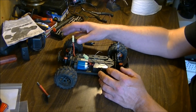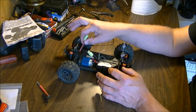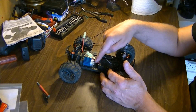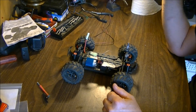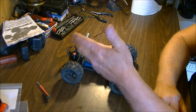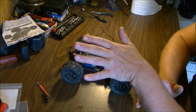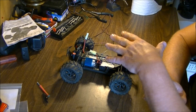Hopefully that explains it. As far as coming off the battery itself physically — I wouldn't do it, because you've got to take your battery out of your car to charge it, or you may have multiple batteries, so that's kind of a drag. I would go off the battery connector off the receiver, and then as soon as you plug it in the fan starts running. There's no interference and you're not going to overdraw anything from the ESC at all. You could overdraw if you're going to do it from the motor wires and have it activate when you drive and deactivate when you stop. In some machines this can work well; in this machine I don't know for sure — it's up to you to experiment.